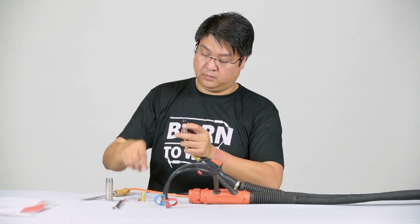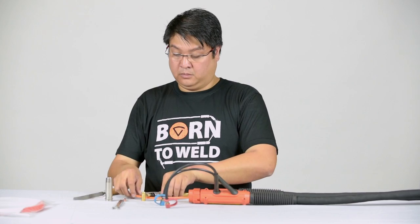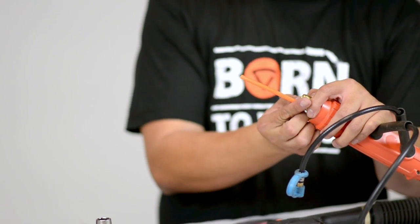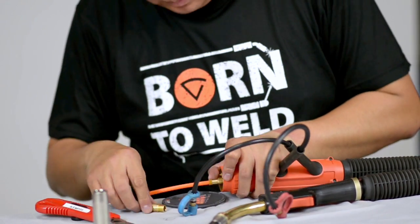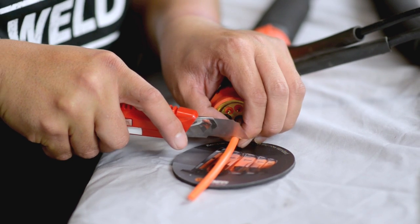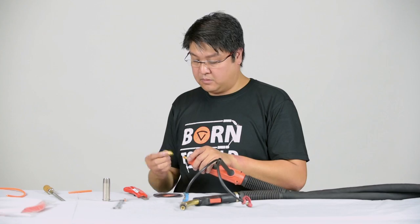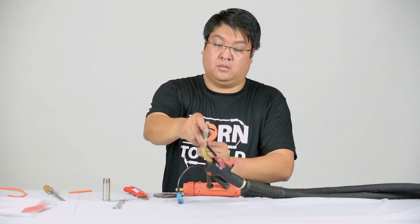Insert the gas diffuser and screw the contact tip adapter about one and a half to two revolutions onto the thread. Do not fully tighten the contact tip adapter as yet. The Euro brass jacket nut has a marking on the side which you can use as a reference to mark the liner using a sharp knife. Mark the area of the liner where you want to cut, making sure to allow at least 6-10mm additional. With a sharp knife, cut the liner at the mark with a forward and backward motion. Then go to the Euro connector back end and secure the jacket nut, leaving an extra 10mm in the front and back. This will make sure that there is no gap inside the torch.